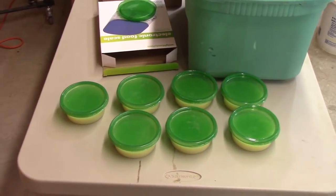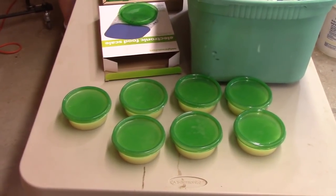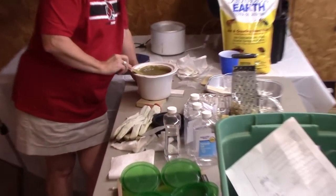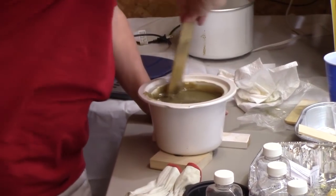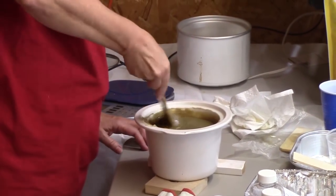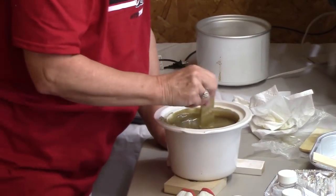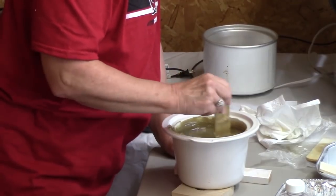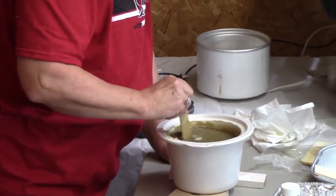You can pour the sanding butter while it's hot and melted into a container, but when it comes to the sanding paste — which is an emulsion that needs to stay in suspension — you need to keep stirring it until it's just about dry in the pot and then scoop it out. Otherwise, if it's still melted when you set it, the heavier particles will sink to the bottom. Not good.